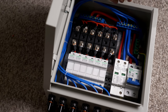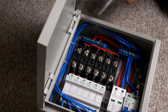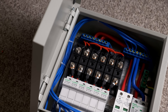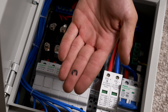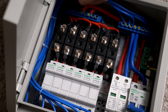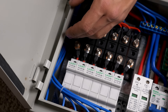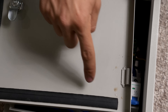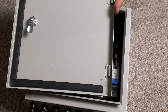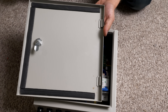I'm going to use needle nose pliers to pull the pins out here that are holding this door in place, so we can get clear working space. They have a little C-clip and the pins can just be pressed out. This would be truly difficult to do every single time you want to open this panel. The other thing I want to mention is this gasket is only on three sides — they omitted it on the hinge side. So that IP65 rating is pretty much only good on three sides.